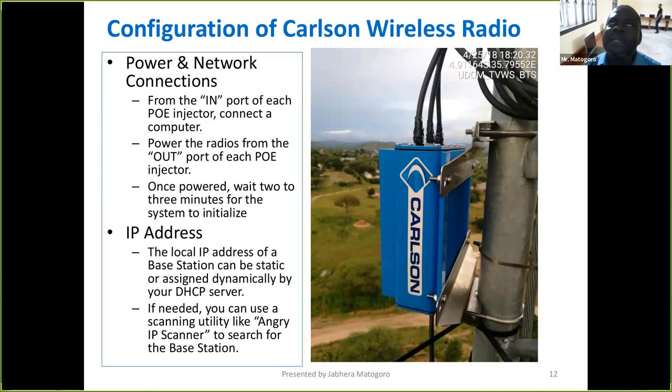The longest distance that we covered, I think, was around 5 kilometers, but the device can go up to 10 kilometers. So you can see just with one base station, you can cover a radius of maybe 10 kilometers without requiring a repeater or another device in between. So that's also another advantage of the technology, because it has very strong propagation characteristics to penetrate trees and any other obstacles,